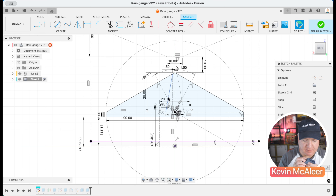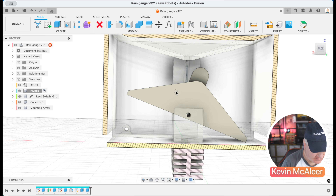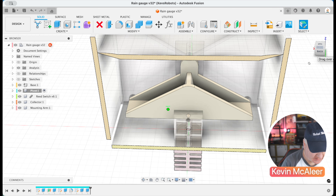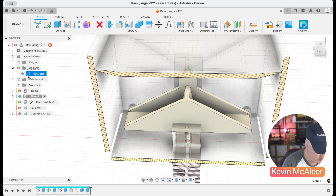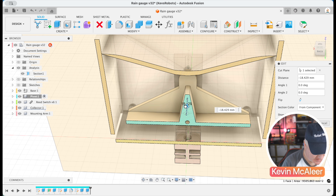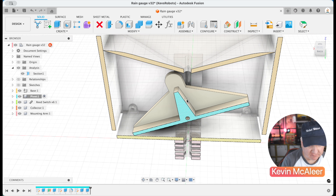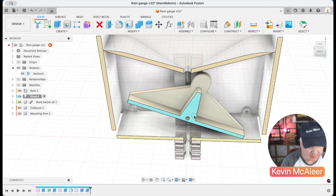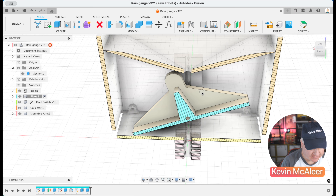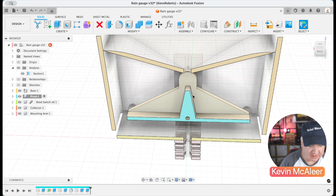The walls of these buckets are not absolutely straight inside — they've got a bit of a slant to them. That's just to offset the water slightly so that it has that tipping factor compared to the pivot point. We can see that pivot just teasing past the reed switch there. Using a sectional analysis tool, we can go through the model one bit at a time. When this is tipped, we can see the water will go into the right-hand channel; once that gets full, it will then tip to the other side.